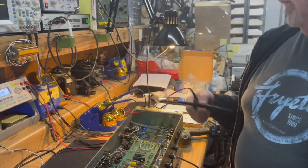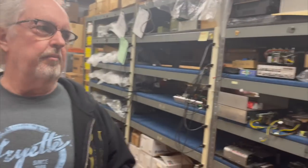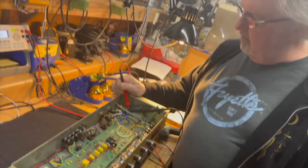if you powered it up within a year or two, they don't need to be reformed. And that answers your question, do I need to bring up the voltage slowly? I don't know if you were asking me, do I need to bring them up slowly after I replace them? That's, yes. Okay, so the normal question you would ask in an amp that's been in storage for a long time, do I need to bring up the voltage slowly because it hasn't been turned on in a long time? And then somebody would say, well, why don't I just recap it? And then should I bring them up slowly after I recap it? And my answer is always, how do they look? Do they look good? Do they test good? Oh, well, I don't have a test. I was just going to replace them because that's what everybody says to do. And my answer is always, we test them first and see if they need to be replaced.